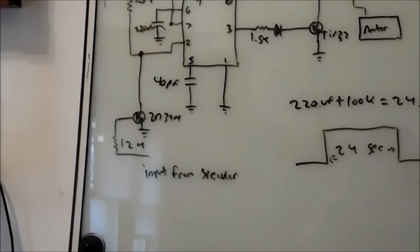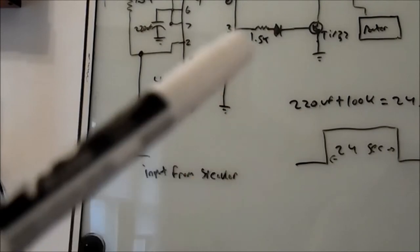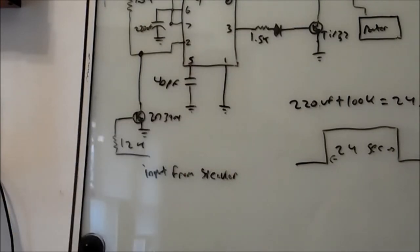It's a really simple circuit with not a lot of parts — pretty cheap. I'm using a 2N3904 transistor for switching pin 2 to ground, since it's a relatively low signal. For the coil switching I need a decent-sized transistor, the TIP32, which is the only one I had on hand that would work best. On pin 3 you can see a resistor and a diode — the diode is needed because without it there would be interference from the relay coils messing with the signal. If you want more time, increase the capacitor value, or add a potentiometer on pin 7 to 8 for better timing control.